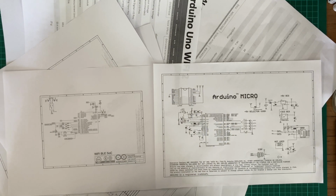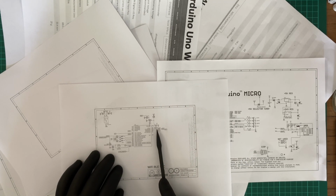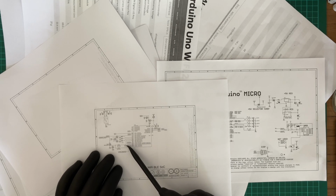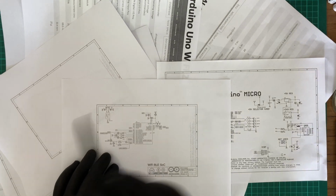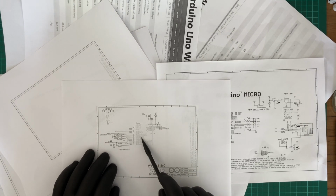This is the Wi-Fi module. This is useful if you're programming it from scratch. Where's the pins? Oh, so SDA, SCL. So this is working on that thing where you can stack multiple of these chips up. So you could have like 4 or 5 different Wi-Fi chips if you wanted for some psychotic reason. Although there can be some legitimate reasons for doing that on just the one Arduino. You can have as many as you want. You can also hook up other devices that run on this sort of channel. And you just say, hey, I want to communicate with device number 13. So yeah, that's the built-in Wi-Fi. And that itself is probably going to be useful for some... It has GPIO pins, so you could program this like an Arduino as well.